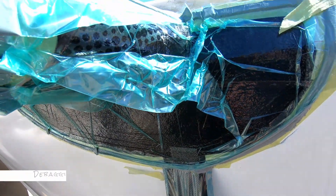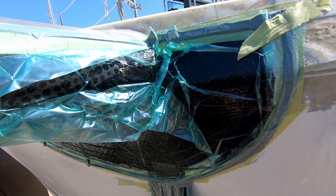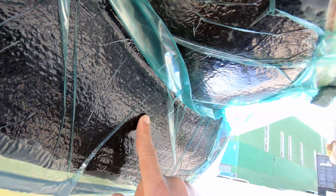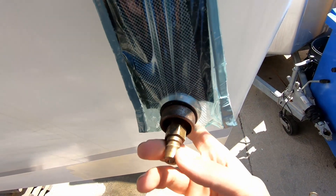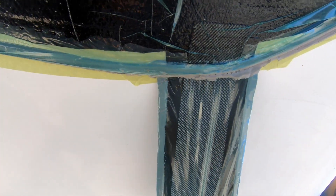Here's the finished product after the resin's cured — the bag is now ready to come off. You can see we've had quite a good bleed; it's actually bled and filled the whole breather felt, which is an indication that quite a bit of resin was used. You can see the frog's tongue has worked — the resin entered the start of the frog's tongue and only made it as far as the tacky tape, but the rest of it has no resin at all. So no resin has gone into the breech valve or the vacuum pump hose. I'm going to now pull apart the stack.